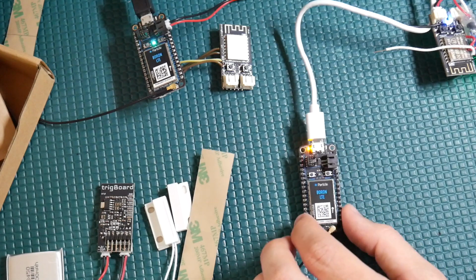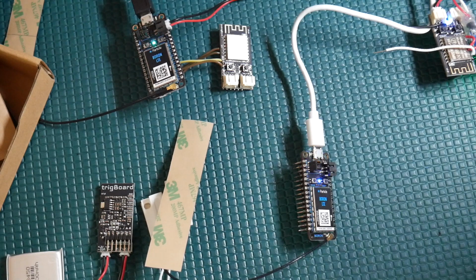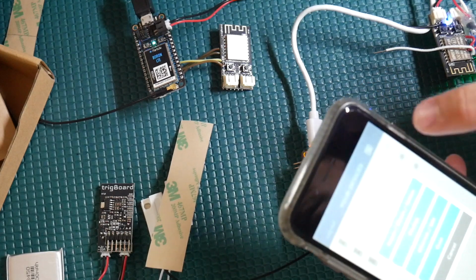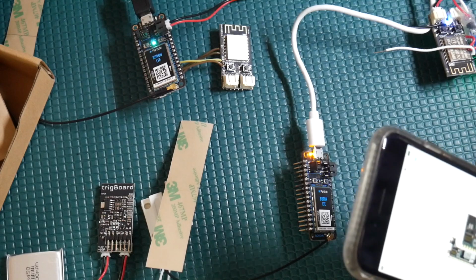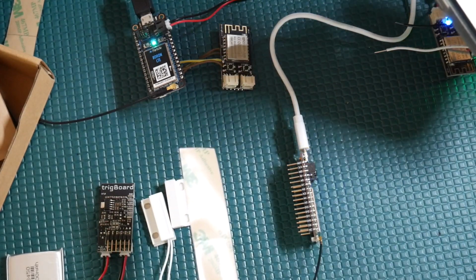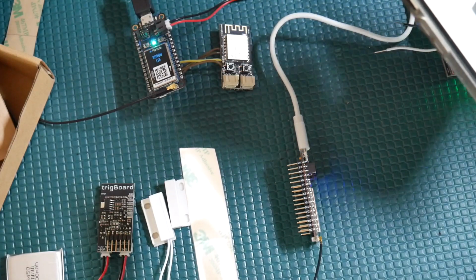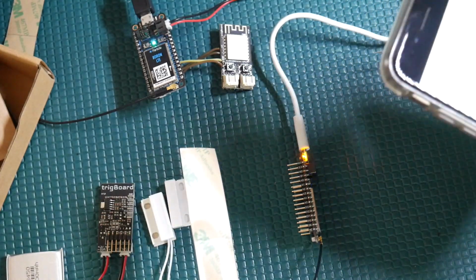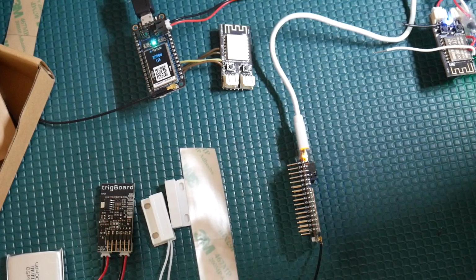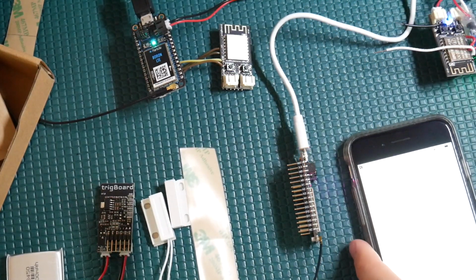Alright, so we see the blue light there flashing on it. On the app, you should see the Your Devices screen, and at the top right, you can click the little plus sign, and we're going to add Boron, scan the data matrix. Okay, I have attached the cellular antenna and see the device is blinking blue, check, and click next. Pairing with your Boron. Congrats. Fully paired. And it wants to update, so I'll click begin update. And we'll let that just go.